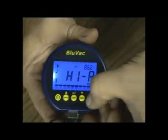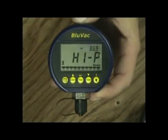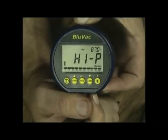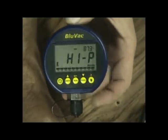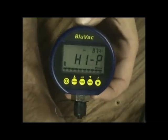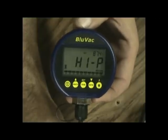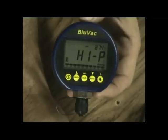It does all the popular units, has a nice backlight, and you can turn the beeps off if you want. The Blue Vac is temperature compensated and shows you the temperature right on the face — it's reading 86.9°F right now, and it's super sensitive: just put your hand near it and you can watch the temperature climb. But it knows this and adjusts the display accordingly. It has super accuracy with one-tenth of one micron resolution in the lower ranges. It's also field calibratable — you pop it in the freezer, wait for it to reach temperature, then follow the calibration protocol in the manual.